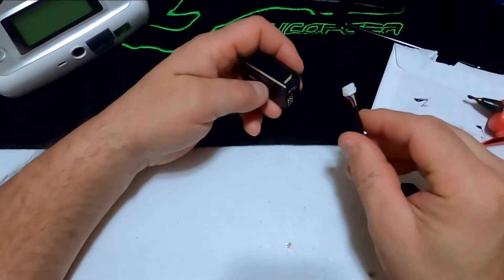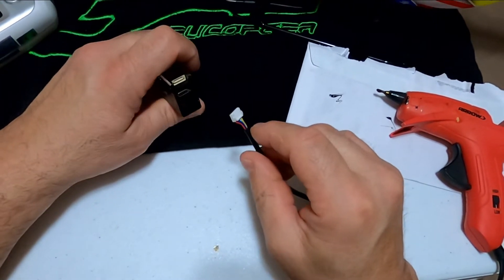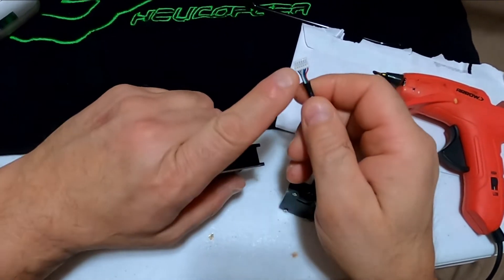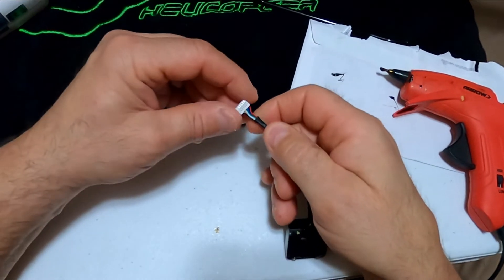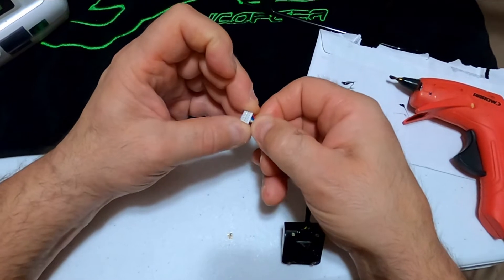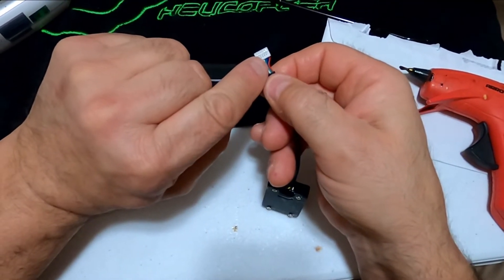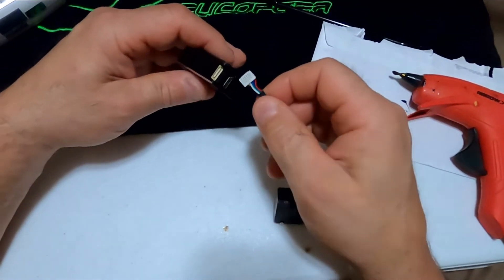This is a locking clip — I forget what they call them offhand — they're not a balance lead connector but a similar locking one. Make sure it's locked in; make sure every one of these wires — you can see the metal — they're actually in. You can pull on these and see how much they move. All it takes is one of those little tiny white clips to come loose from a wire, and just one wire coming loose that's supposed to be doing something.